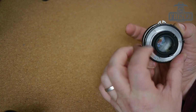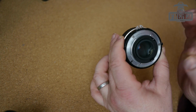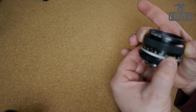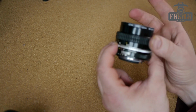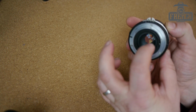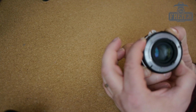And what you want to make sure as well is that all the blades are clean and dry. You don't want to see any oil on the blades. The focusing ring is greased with a special grease, and if it's exposed to heat, this grease will separate and some oil will go away, and if it reaches the blades, you're in deep trouble, because those blades are made to move against each other without the need for any oil.